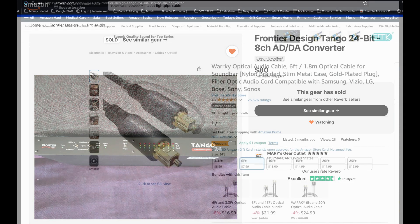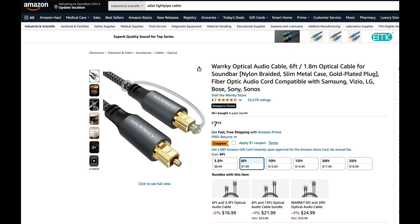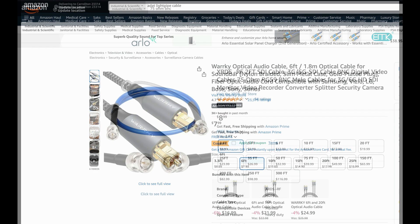In order to make these connections, a couple of cables need to be purchased. I went over to Amazon and picked up these ADAT lightpipe cables, which may also be referred to as TOSLINK cables — just so there's an understanding, they're the same thing. The TOSLINK cable is the physical connection for these optical cables, created by Toshiba back around 1983. ADAT lightpipe was created by Alesis in the early 90s and is more of a protocol for communicating over these cables, allowing eight channels of audio to be transmitted simultaneously.